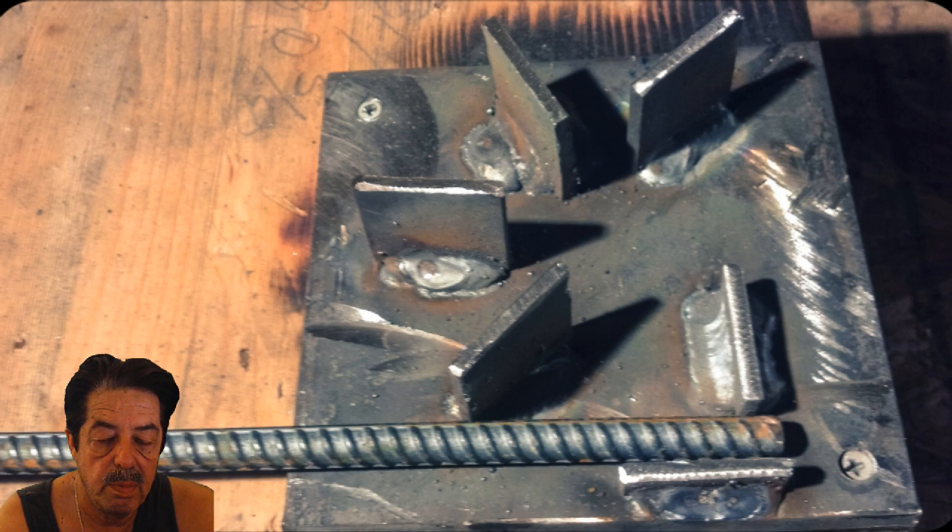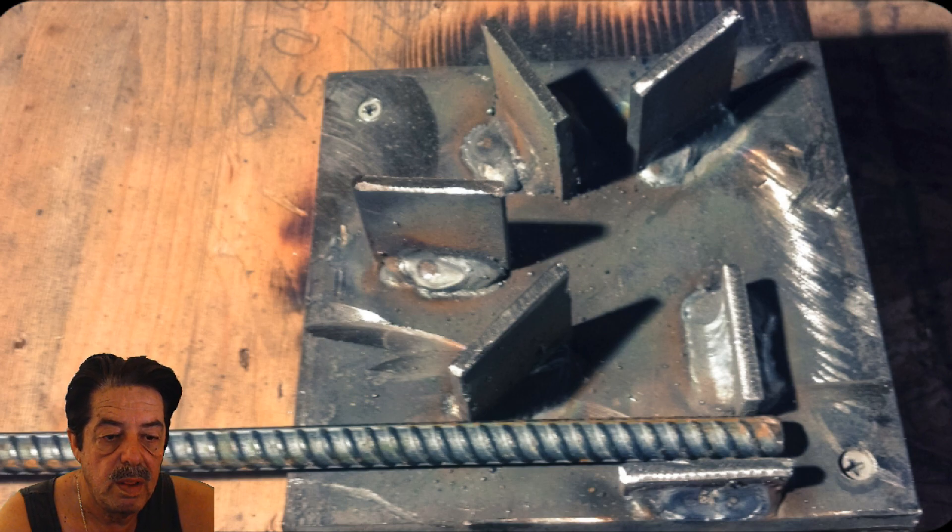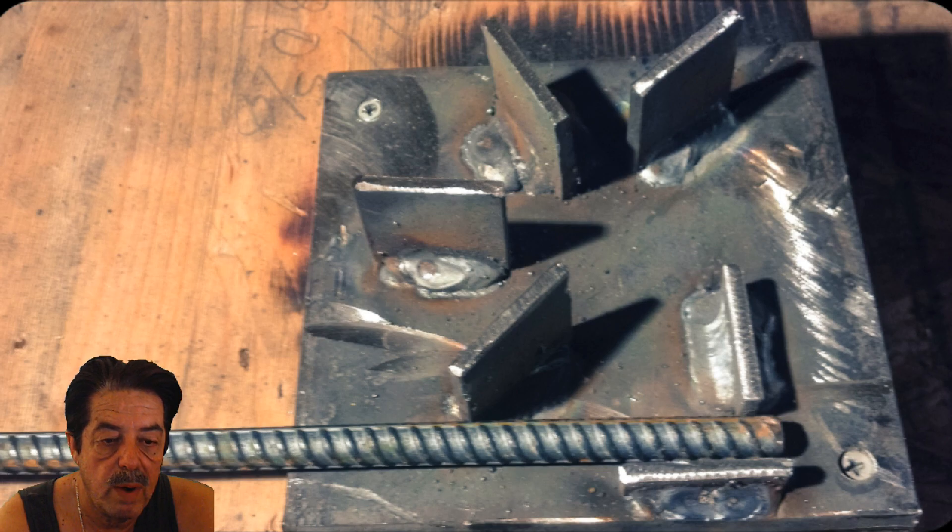Where you see the rebar in the picture coming up to that first piece, we did it in a similar way. We made the outer piece of steel with just a little bit of play — maybe an eighth of an inch — where the bar sits in there. Then we heated the steel. In this case instead of rebar, I think we were heating half-inch round steel. We heated it and slowly started bending it around those tabs, coming all the way around into a circle and overlapping the beginning just a little ways.